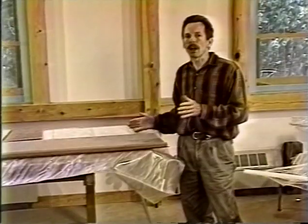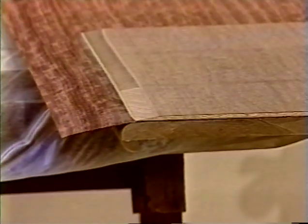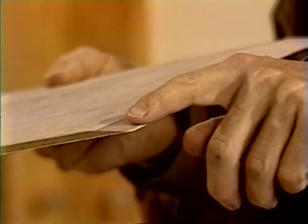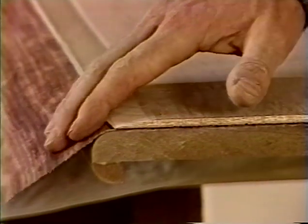You can do it all at once with a feathered caul on top. The flat part of this panel requires a caul to guarantee good results. See the way this sample caul has been sanded down to nothing along this edge? If you put it close to the bullnose, the bag will go off it smoothly and right into the curved edge without creating a ridge here. I prefer to do it in two steps. That way I can concentrate on the curved forming without worrying about the flat part at the same time.